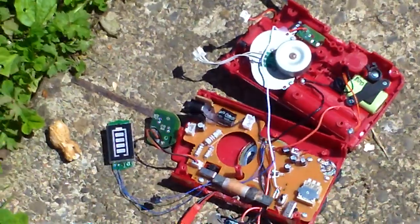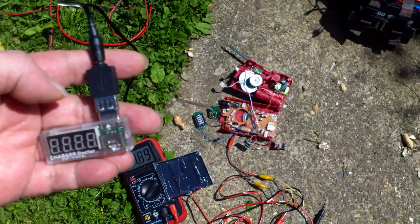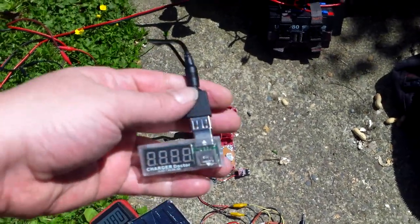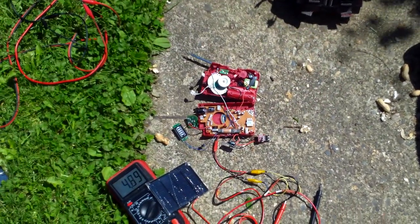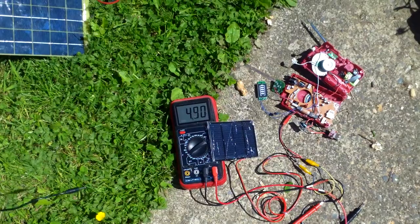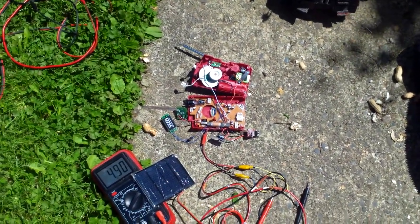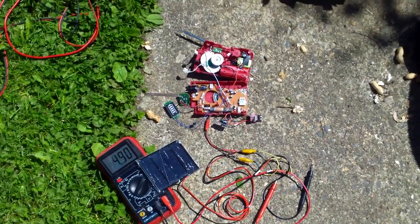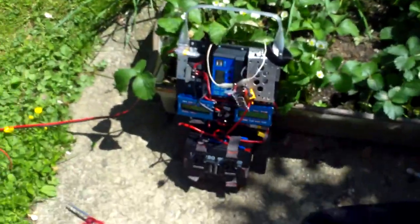Finally I took my toys out and tried them in the sunshine — I'm happy as hell about that. I was going to try to plug a device into this while it's charging off the solar panel. It should put out a 5-volt output to run it, but it's not working. It's only about 4-point-something volts, and the regulator is going to bring it down further, probably to around 4 volts or less.